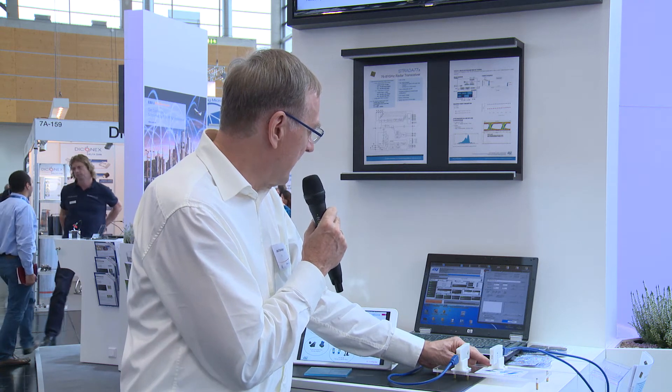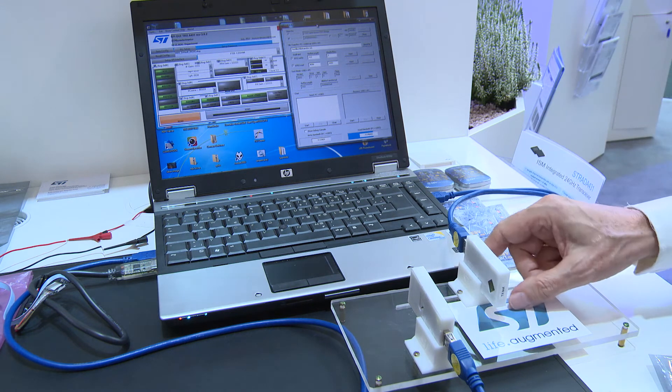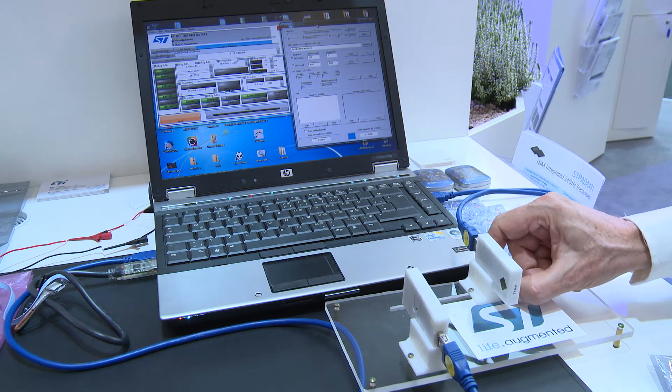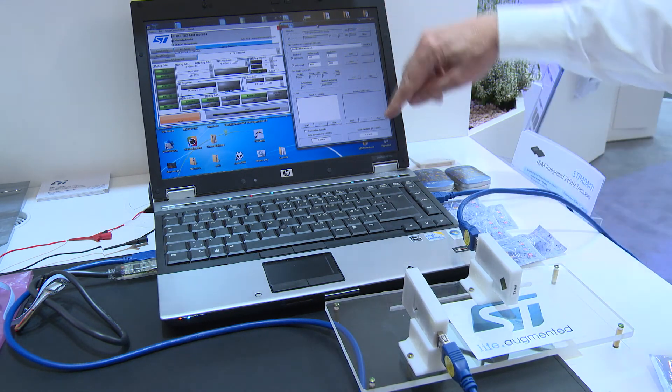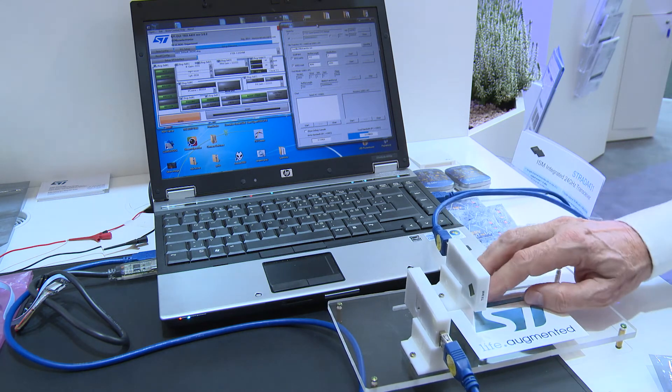You see that plastic material from a certain distance onward is also influencing the communication. If I increase the distance further, at some point we lose the communication — we have no sync and, of course, we have errors. And then at some distance, we lose the sync entirely. If we have no sync, there are no errors anymore.